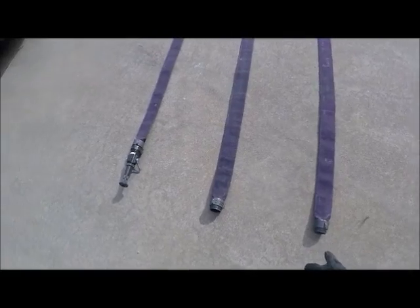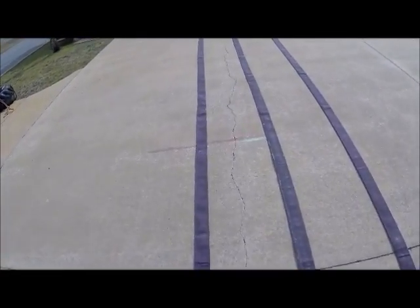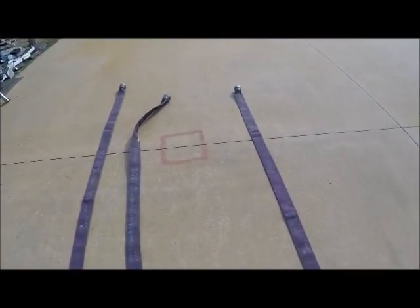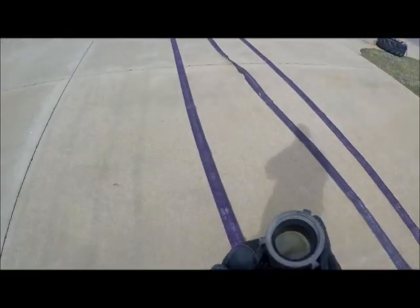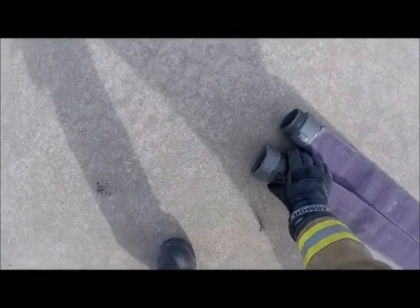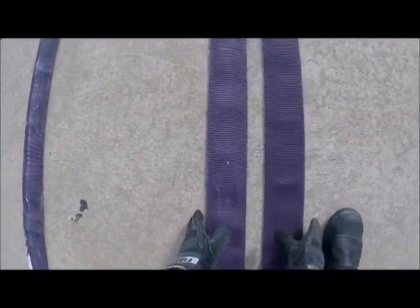As you can see here I have the male end of each including the nozzle section. What I'm going to do is bring the female coupling to the male. We'll start with the first section — just going to walk it straight up, make it even with the male coupling. This will keep everything in line and straight.